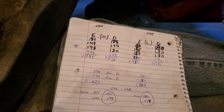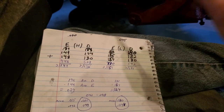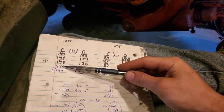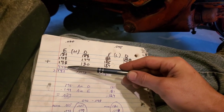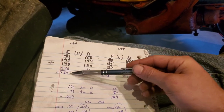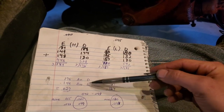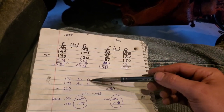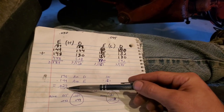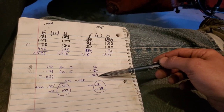All of the numbers in marker here are the numbers I got out of the tractor. What I did was I added them up and to get my average I divided by three. Once I got my averages for everything, I took my two averages — disengaged and engaged — subtracted them, and came up with 27 thousandths on my high clutch pack and 24 thousandths on my low clutch pack.